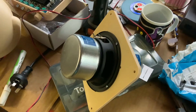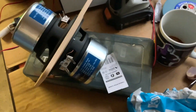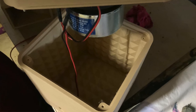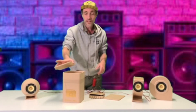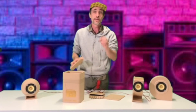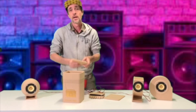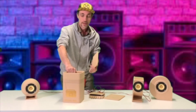An isobaric sub basically means there are 2 drivers on top of each other, facing each other. The top one faces forward, which means it's wired negative-positive, positive-negative coming off the back of the other one, and the other one is wired normally — positive and negative out normally as well. It's a really interesting trick, and the trick of the isobaric chamber or isobaric sub is designed to save space. So instead of having one sub that requires a 50% bigger chamber, doing the isobaric trick means you can have a smaller enclosure and still produce that nice sub sound.